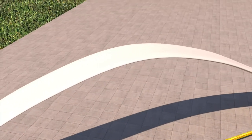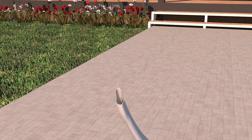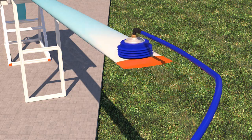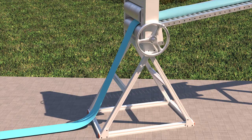After camera inspection and cleaning the pipe, a piece of flexible liner is cut to fit the entire measured length of pipe. Next, our QuickPox resin mixture is poured directly into the liner opening. The liner, with a vacuum seal attached, is then fed into a calibration roller table to ensure that every inch of the liner is fully saturated with resin.